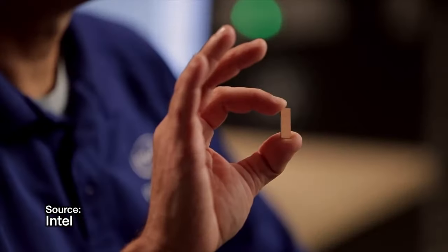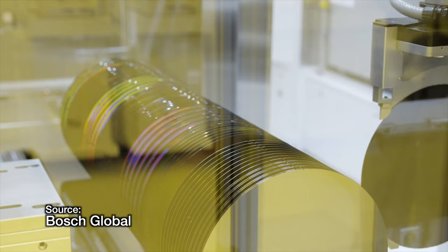However, even with those two fewer cores, the remaining 6 cores meet all of the same performance and stability requirements of the chip with the higher core count. The term for these metrics — how many dies come off a single wafer and how many of those dies are fully functional, partially functional, or completely broken — is called a yield. This yield process has been in processor manufacturing for literally decades, and it's a good way of seeing how good your manufacturing process is based on how many wafers come out with 100% yield, 90% yield, 80%, and so on.